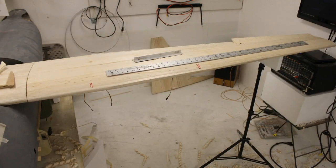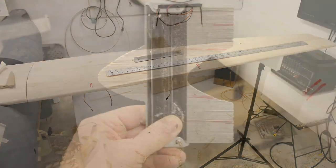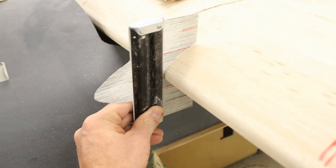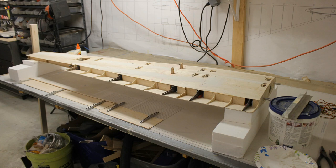A lot of people ask me why their planes stall so abruptly. If you have a pointy leading edge, the airflow makes a very quick decision whether to fly or stall. If you have a really round leading edge it's much more predictable. I take one of these gauges from Home Depot or Menards, make sure it matches the airfoil I want — which was very scale to the real C-130 — and I sand my whole wing to make sure it conforms exactly to that.